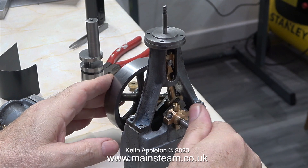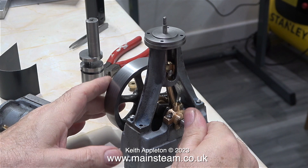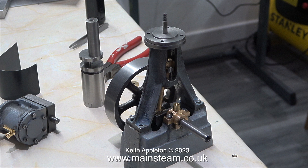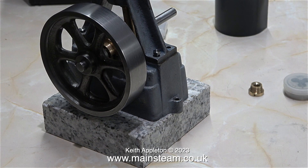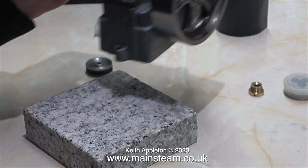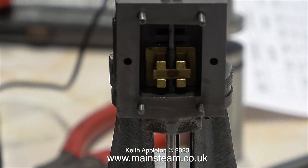Here's the story so far on the 7A — he really is getting on with this. Andrew intends to finish this engine using an unorthodox method: instead of painting it like everyone else does, he's going to varnish some of the metal parts and leave them metal, for instance the flywheel spokes. He's machined the flywheel to my instructions — make sure you get the inner part through before you start on the outside. Once finished, he's going to mount it on a piece of composite marble-type material, though the sample piece shown is too small.